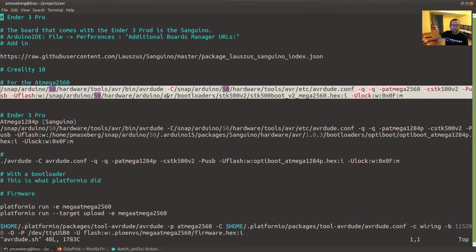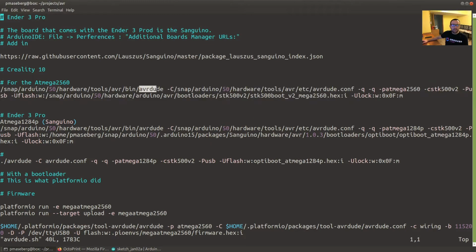Now this was pretty convenient to me also, because when you configure the Octopi, I needed to understand some of how it does it also, and it uses AVRdude behind the scenes, and so you can check all these different options and see what's actually happening when you're changing GUIs if you need to dig around behind the scenes.